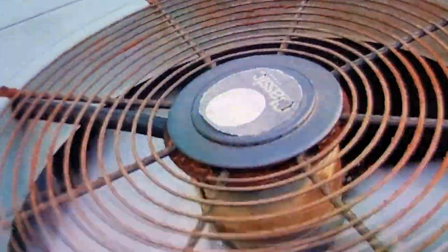I think, what's all this noise over here? A lot of different vibrations going on here. You can feel the high frequency up here, and down here it can feel like a 1 per rev vibration. So that's gotta be the fan.